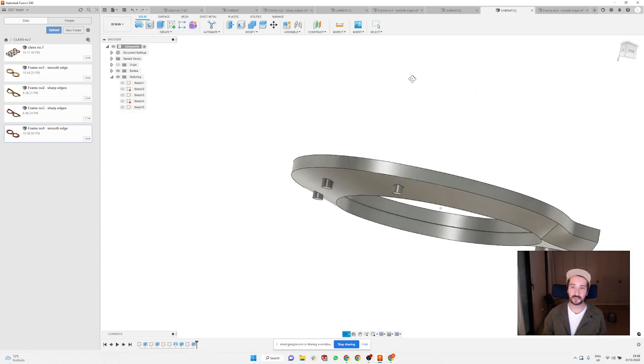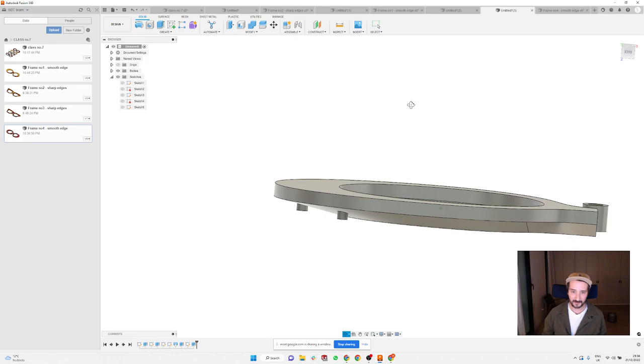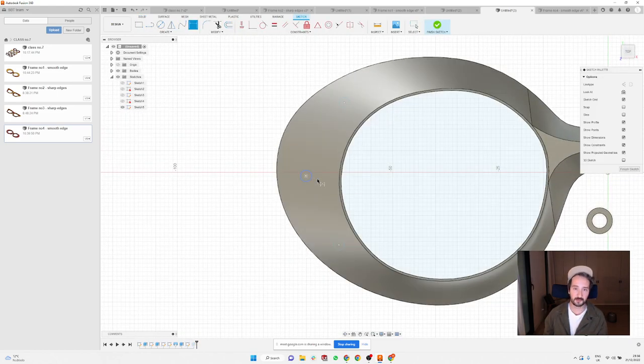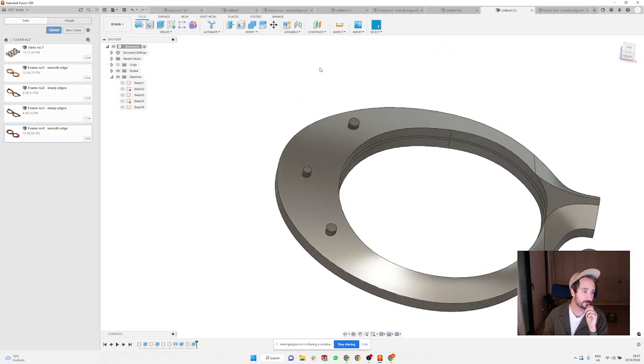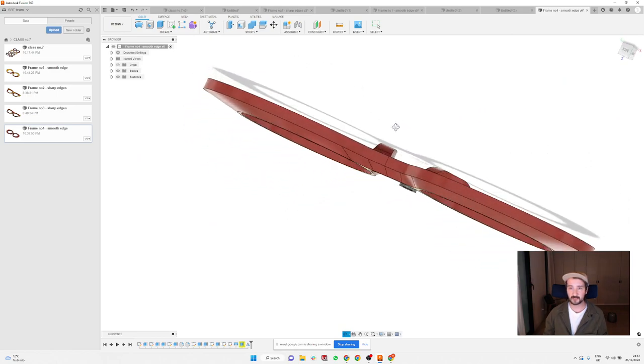So when I do the groove and I'm trying to cut it out, it will help me to have the frame perfectly flat with the surface. And because it's such a small thing, it's very easy to just use sandpaper and get rid of them afterwards. You can even maybe use 1 or 2, but normally this is what I would do. If you make them 2 millimeters, that should be plenty of surface to give you a bit more guide and support. With the other version, it's not a problem because you have the center and the top is still the same thickness, so there shouldn't be an issue. Only in something like this, it's good to have some support.